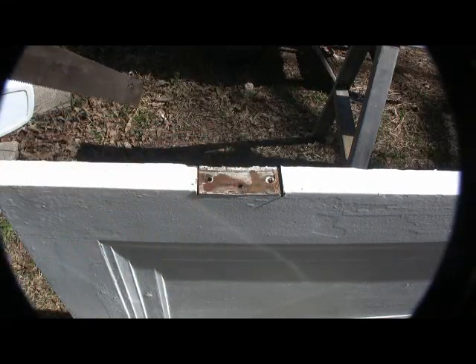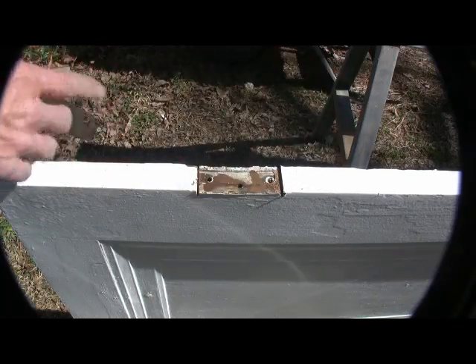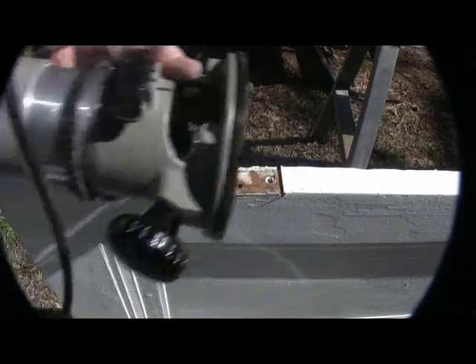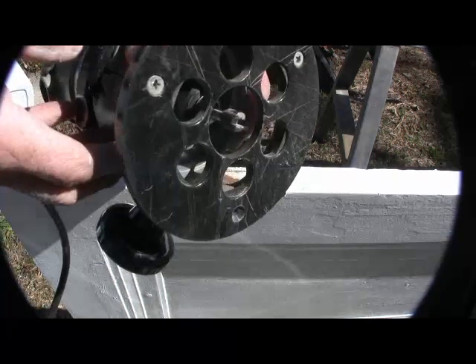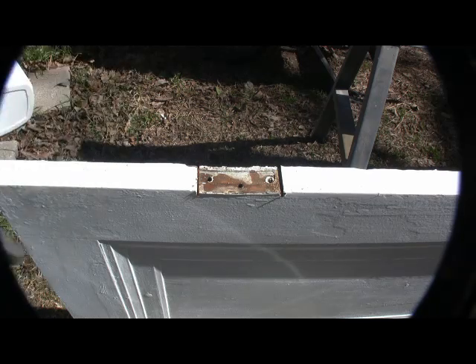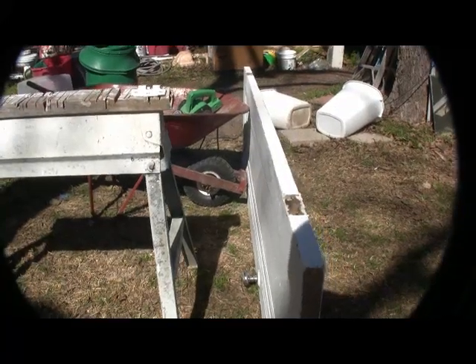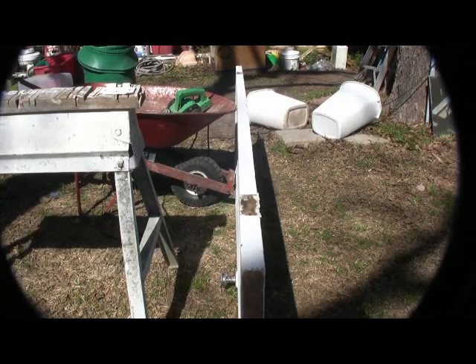You can see I cut my two grooves. Now what we'll do is set our router from here to this depth, so after we plane this we'll still have the exact same depth as we do now. We've got our router set, now we'll take our planer and clean this edge up. We'll take about three passes because this thing was awfully tight — we don't want to have a problem later on down the road. Being that this has got probably 40 years of paint on there, it's going to wipe out our planer blades.